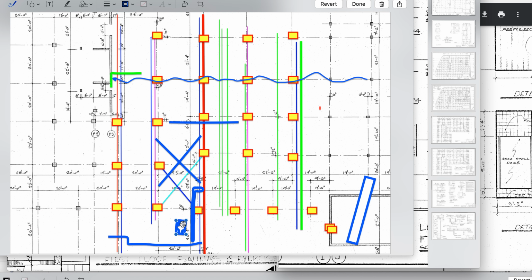So this whole staggered system is what I'm driving at, creates a form of perforation just as you load the vehicle. It's not going from one tributary area to the next, nice and smooth. The only tributary areas that are smooth are back here, not even smooth because they're also 3-sided because they have the BMAs back here, so they connect here and with the L-shaped anchors. This one, the steel is going across this direction. There's some steel coming this way, including the transfer slab.